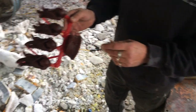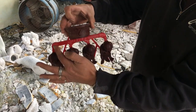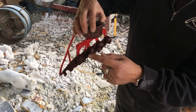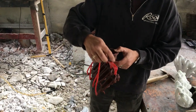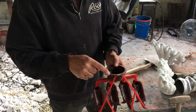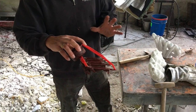Instead of casting one otter at a time, we put four on a sprue. Everything we do in wax will become bronze. We produce a pouring cup, and the bronze goes down from the cup through the main sprue and into each individual piece. The whole assembly gets totally encased in ceramic. Air vents are critical — without them, air would be trapped at 2,000 degrees as the bronze pours in. The bronze forces the air back up and out through the vents at the top.